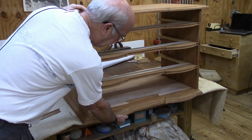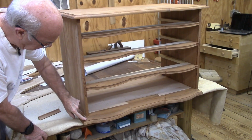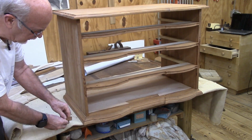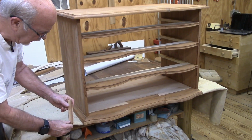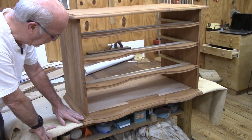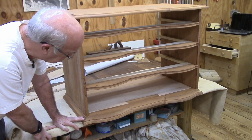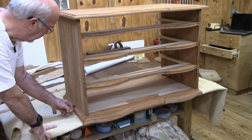to make the piece that's on the bottom here, and that had to be attached first to make a shelf for this piece of molding over here, which is a piece of cove, which goes along here. Again, I made this on a router with a cove bit, ran it across and then sliced off. I only needed 2 pieces for the side here, but the actual shape was not exactly what I needed, so I had to carve out a little bit of it, but it pretty much matches what I did before. And to attach it, I glued it about this much and then pin nailed it.